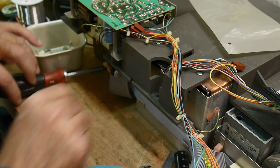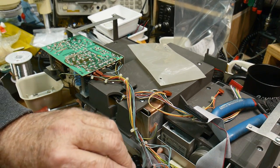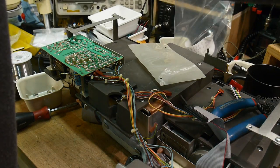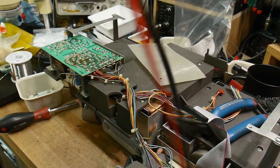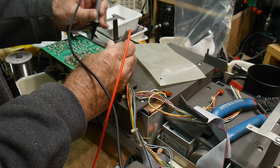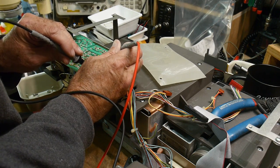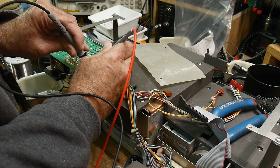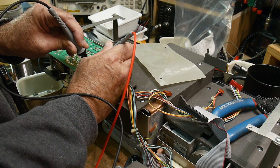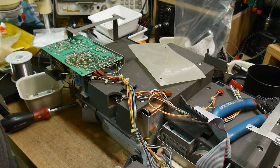All right. All right, we'll do this live on camera here. Let me turn the power on. No sparks. No smoke. And let's probe for some voltages over here. This looks like ground to me. And all right, so I think this is a floating ground over here. So this is ground. And we have minus 11.4, 12.5. Ground, and this one better be 5.3. So I say the power supply is working without a load on it, at least.